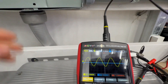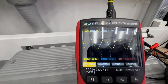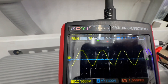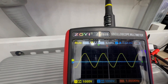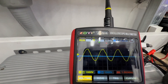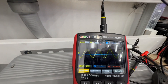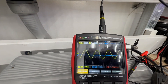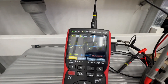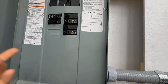Next we're going to shut down one of the two inverters and go on a single inverter. It looks pretty much identical to before, which it should — when running in parallel, the two inverters sync. I've heard people say there are potential issues with parallel sync, but as long as you do the proper procedure, make sure the software is set up correctly, and test the first time, there are no issues after that.